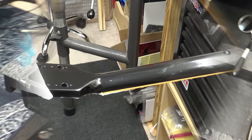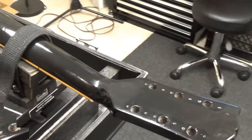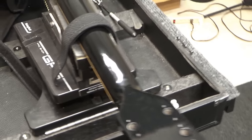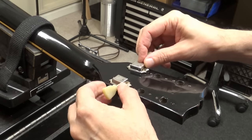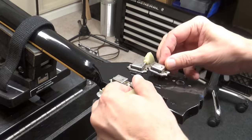I had a few extra days with the guitar, so I went ahead and did about 15 coats of French polish, wet sanded, and hit it with the Meguiar's Mirror Glaze 105 Ultra Cut Compound and a little bit of carnauba wax, and she's looking good.